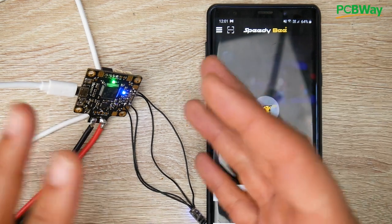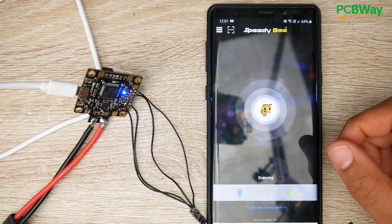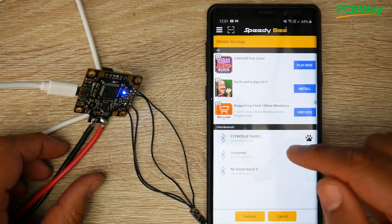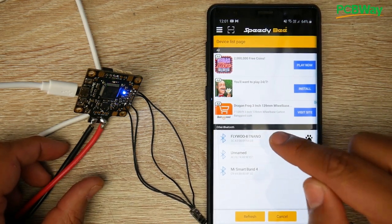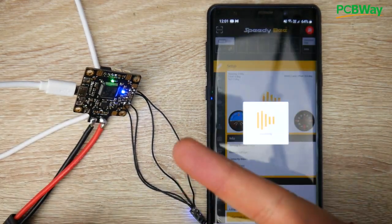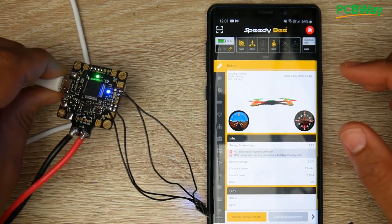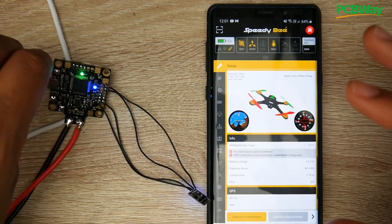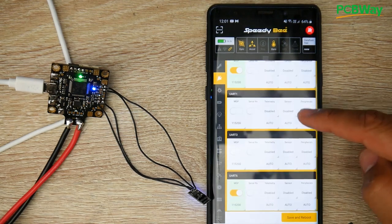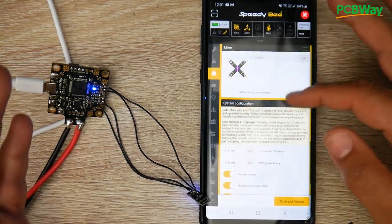Download the app — note that if you're too close it might not connect, so move the device a little further away. No passwords are needed. Once it connects, you'll see the Flywoo BT Nano listed. Click on it and it'll log in. Whether you have iNav, Betaflight, or BLHeliS, you can access all of them. Moving the quadcopter registers live in the app just like Betaflight on PC. You can also see the ports tab where we enabled MSP on UART6 and change anything you want.